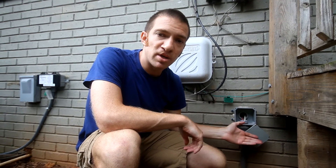I actually recommend having one about every 180 degrees of cumulative turns — so after every two 90-degree turns, I'd put one in. Regarding burial depths: metallic conduit only needs to be buried about 12 inches; PVC rigid conduit or flexible conduit like this needs to be buried about 18 inches deep; and UF-type cable needs to be buried about 24 inches deep. Always check your local code for any different requirements.